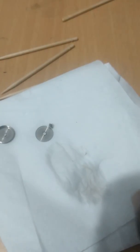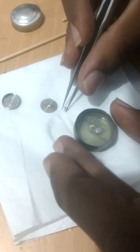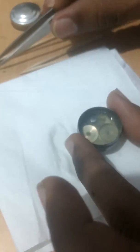Now, final round of cleaning with the pegwood. Now I'm just going to rinse it back in the solution again. Now, I had let the parts in the solution overnight, so I'm just rinsing it for some short interval of time now. A bit of simple shaking of the box may also be necessary to make sure that the cleaning fluid flows into all the smaller areas of the parts. Now I'm just going to drain out the excess fluid again after some time.